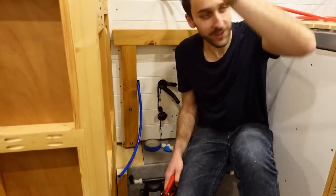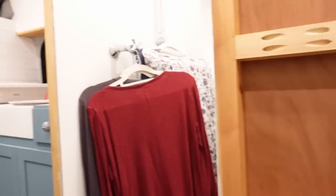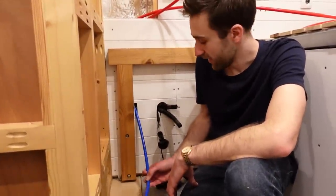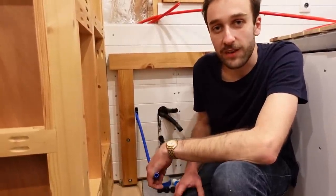The connection pivots around and then we can put our pipe in. This is the part we really don't want to get wrong, because this pipe is one continuous run all the way behind the shower — basically the one piece we can never really get to in order to replace. That's why we left it continuous with no joins, so hopefully there will be no leaks in that pipe.